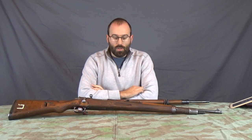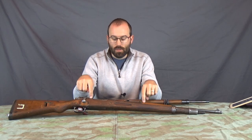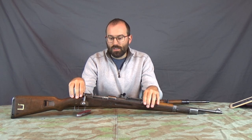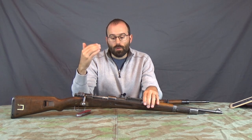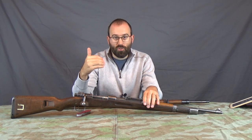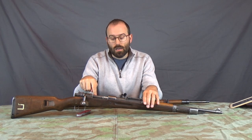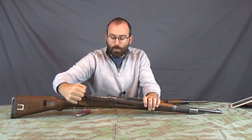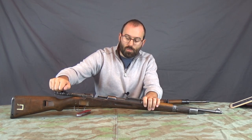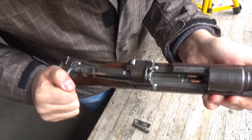Hello and welcome to Bloke on the Range. Those of you who have been following the channel may remember I was having some difficulties with my lovely Mankey Mauser when shooting it. Effectively the problem was that the extractor was absolutely flat-faced and had no bevel or chamfer on it whatsoever, which meant it would only controlled feed - a round could only be chambered if, as you pushed the bolt forward, the rim rode up under the extractor as nature intended.